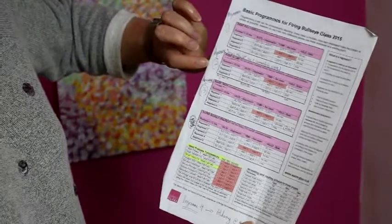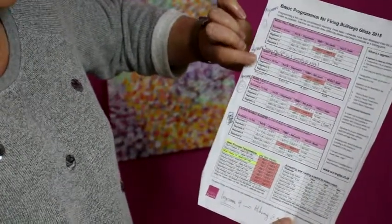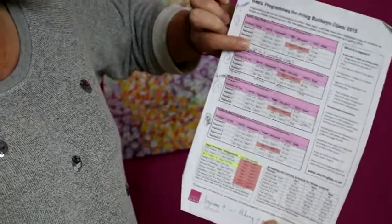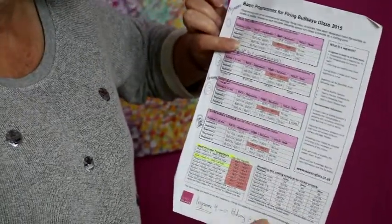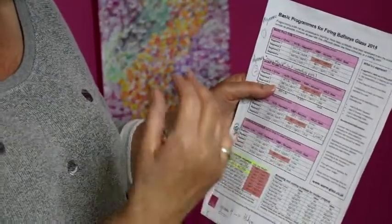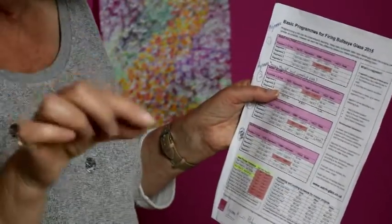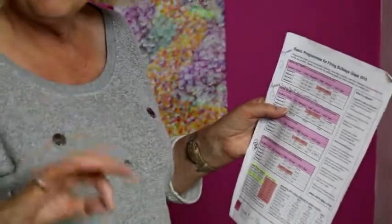So for example, I've programmed program 2 to do a slump program, and we set it for a wave mold. Now each mold will need a different top temperature and therefore soak time. So therefore I would go in and just reprogram that particular segment for my particular mould.